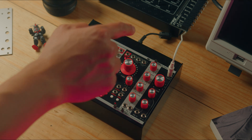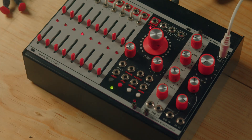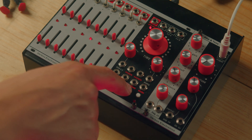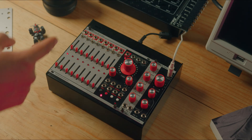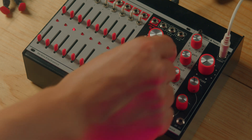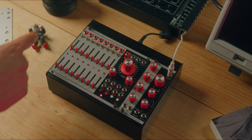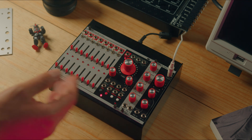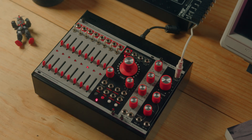On the right side we have a dedicated knob that controls the speed of the sequence, and we also have four buttons with pretty interesting functions. The grey button starts the sequence, the red button stops the sequence, the next white button advances between each of the stages, and the last white button — known as the strobe — helps us jump between the different positions of the stages according to the value of this knob. On this same section we have a voltage control input to choose the position of our stages and a voltage control input to define the time of our sequence. Finally, we have the sustain input that allows us to choose the position of the sustain between stages, and this works perfectly when we use the Voltage Multistage as an envelope generator.